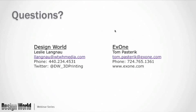Whenever it comes to ExOne's process, I can speak truthfully about that. We can 3D print a prototype part, and you can take that 3D printed part and put it into real applications, depending on the application. A lot of our customers are prototyping with us, and they like our parts so much that it turns into low volume, high volume production. So it's my understanding that with 3D printing or additive manufacturing, those parts in particular can be used as final end-use functional parts. Absolutely. Whether it's with EOS or Renishaw, all those parts, as well as ExOne, can be drilled, tap machined to spec, if not already in spec from the 3D printing process, and then they can be put into real-life applications.